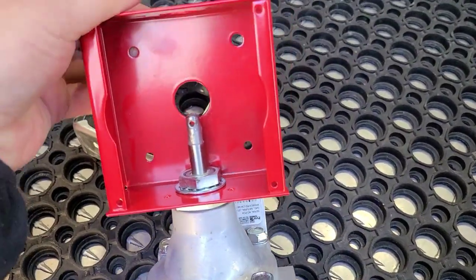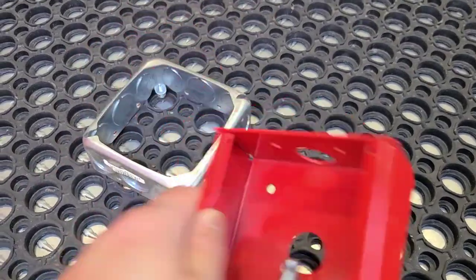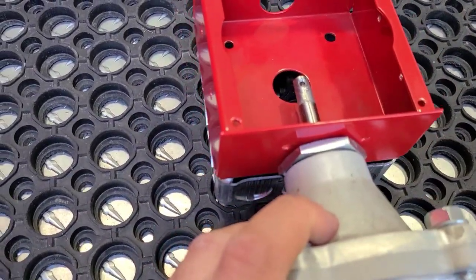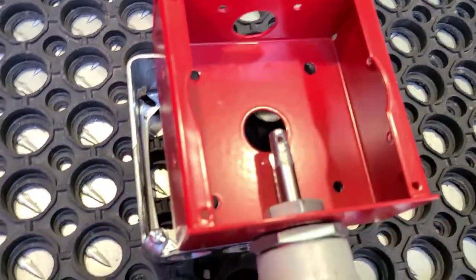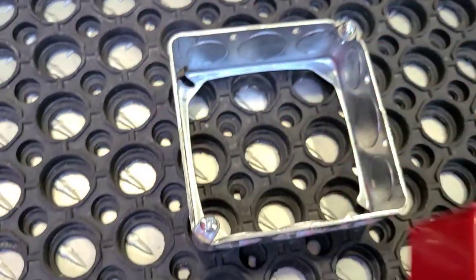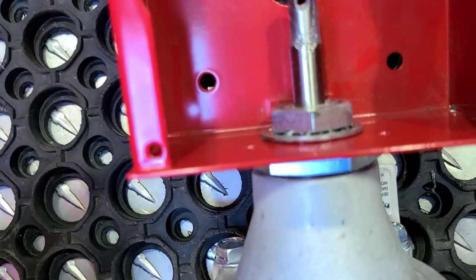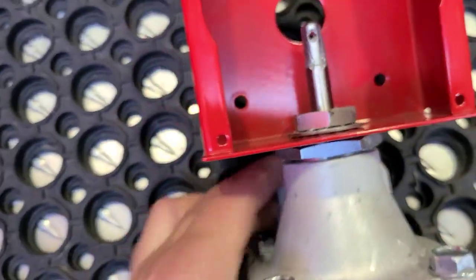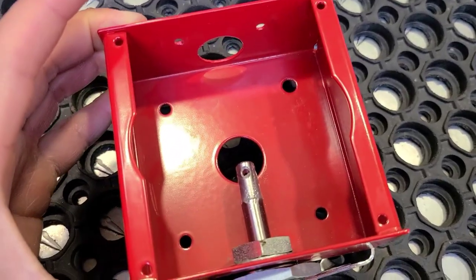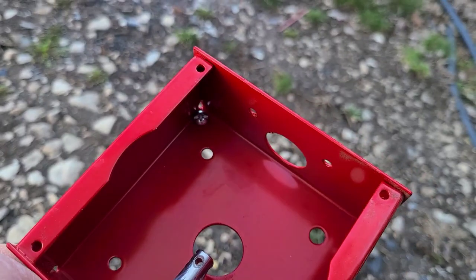We have to secure this — this is the back of that mechanical valve box for the fire suppression system. The cover fits on the bottom just like that. In the corners you can see where the screws go — two screws diagonal to each other, like a standard electrical box configuration. What we're going to do is drill right there and on this corner as well, so the bracket grabs onto this side. The concept is: drill two holes where the screws are, then attach the box.